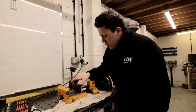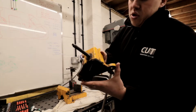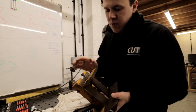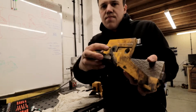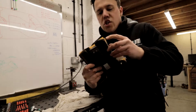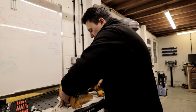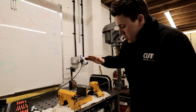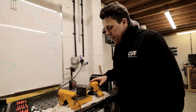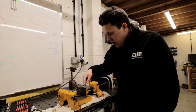We've split this apart now. You can see we've got two halves — this part here is your handle, and then the base is the main vise body with the sliding mechanism. I've just detached it so that's where the lead screw sits. The main reason I've stripped it down is purely to clean all these edges, get the paint off, back to raw metal. I plan to clean it, tack it in place, fit it back to the bed to make sure everything's lined up and nothing moves. Then once I've tacked it, I'm going to grind out the crack to give myself a bit more area to weld into.